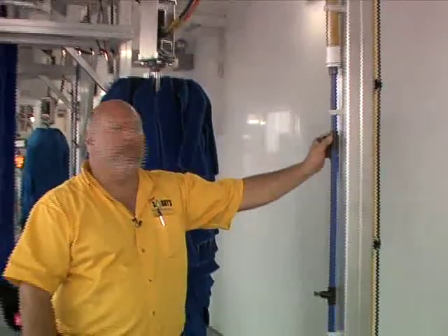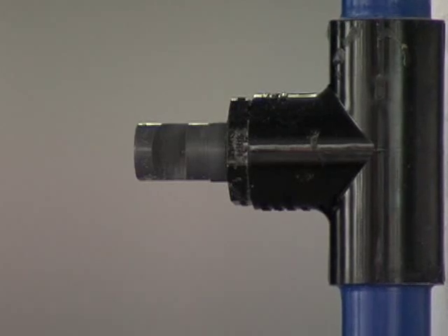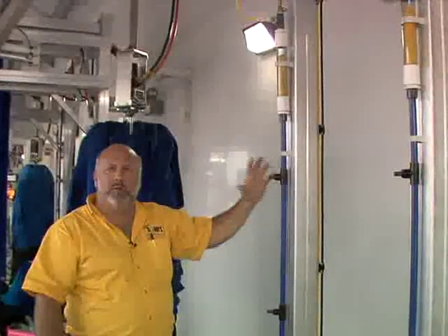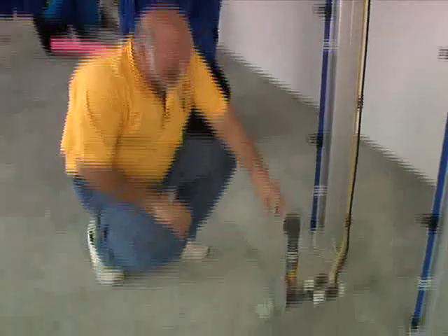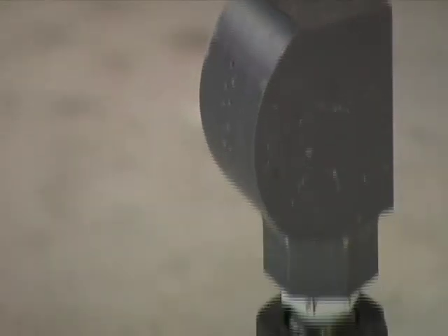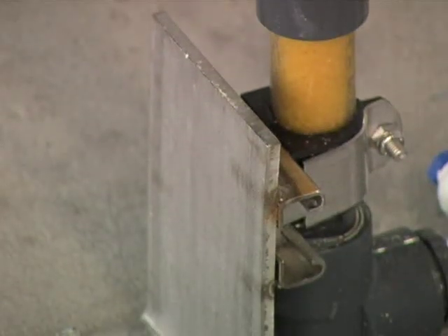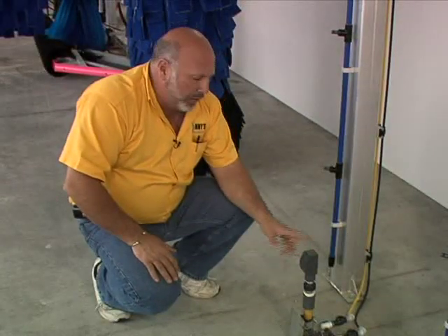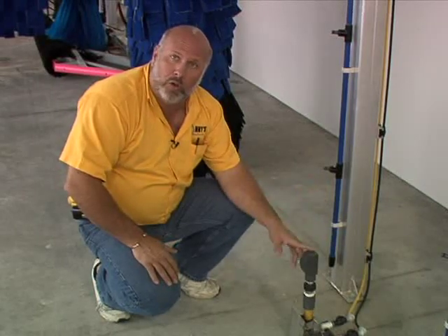Here is our K nozzle foaming applicator. The K nozzle creates a flat fan — big and wide, 110 degrees. The chemistry and the air are forced through a foam generator, and that pressure along with the right dilution of detergent makes it come out and hit the car at a couple of different angles. By pivoting the nozzles or pivoting the manifold, you can get it to hit the front bumper and side, or top and back, with manifolds mounted on side legs and on tops of arches. The second method uses a shower head CTA, which produces a zero-degree style foam in a real tight pattern — different from the triple foam — to control where you're applying the chemistry so you don't waste any. We have a foam generator with air and chemistry mixed at the point of entry. This is a great way to foam on CTAs, regular soaps, lubricating soaps, and emitters.